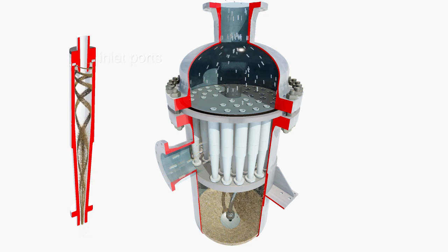This initiates a rotation in the liquid. The centrifugal force, as a result of the rotating water mass inside the hydrocyclone, results in heavier solid particles being forced to the internal wall of the hydrocyclone. Here, the particles move downwards in a spiral motion, exit the liner at the lower outlet, and pass into the sand collection chamber.